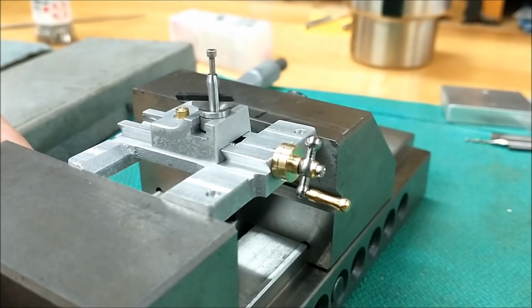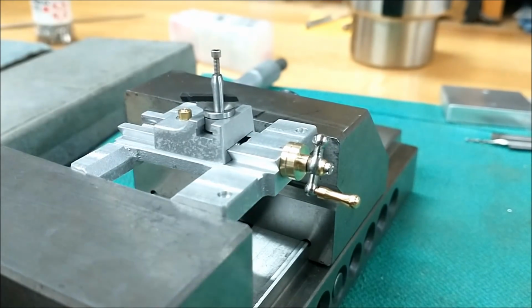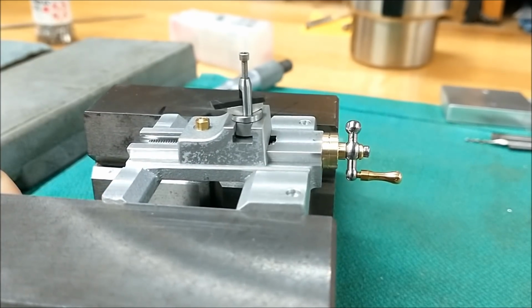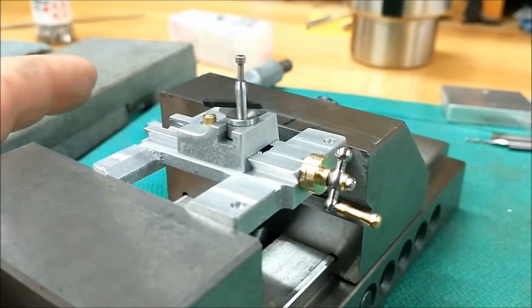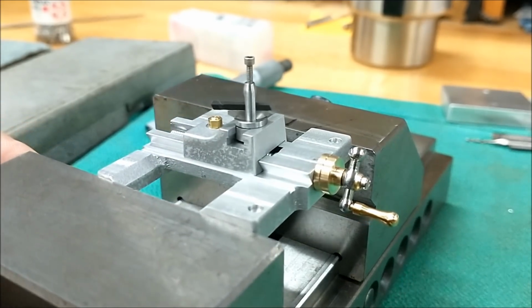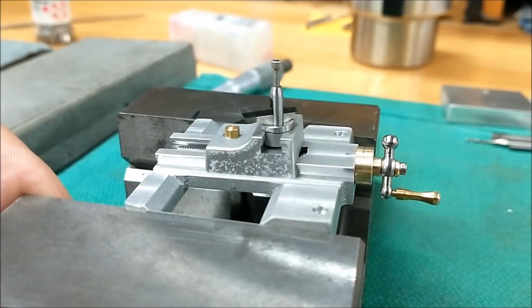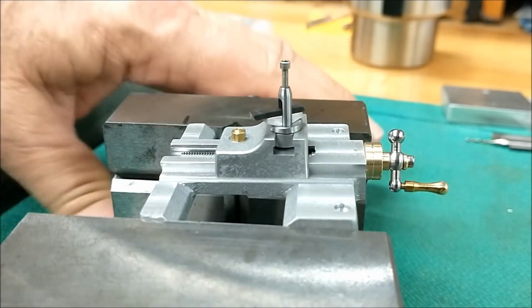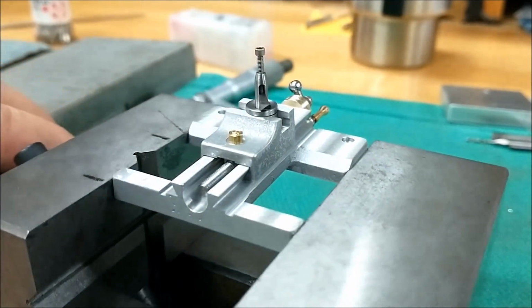Now, in all fairness, I think I need to confess that the brass dial that is on there is strictly a development slug, just to take up the extra space I left on the lead screw. The back half will be pinned to the carriage upper, so it's stationary, and the front half will be driven by the same square that drives the handle. Everything should cinch up fairly tight and spin freely. It will be graduated upon completion. I'm going to modify my rotary indexer for that particular video. Quick and dirty.